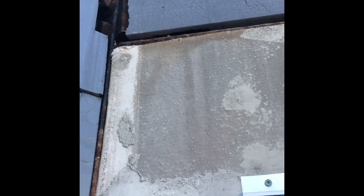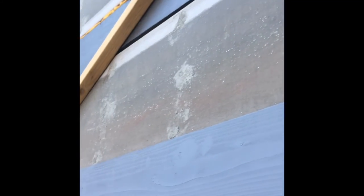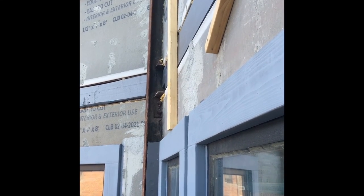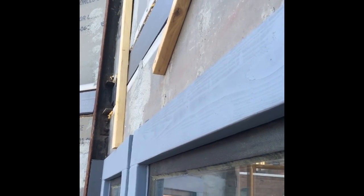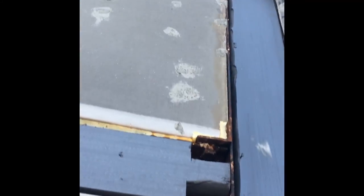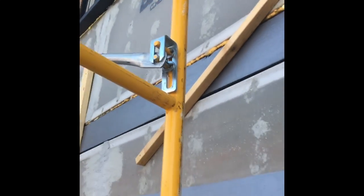And then that part you need to go over on top of that steel mesh. So we're gonna do like we did on the other window well and fit it over these sections of bracing that are sticking out, and then bending over that steel post there. So that's all gonna get wrapped around with the wire mesh like the other side. It's gonna go all the way up to this drip cap here, which is just tacked in place with a couple 2x4s right now, just to keep it in place. And then that's all gonna get parged up.